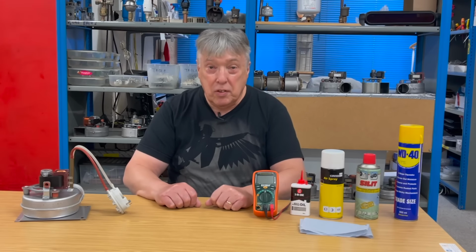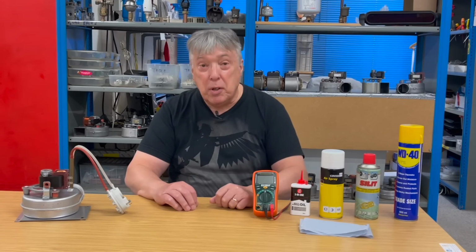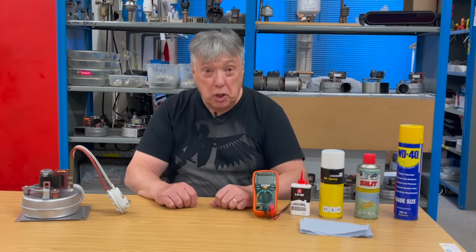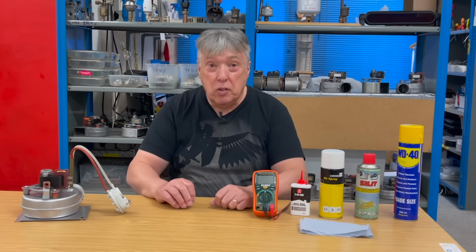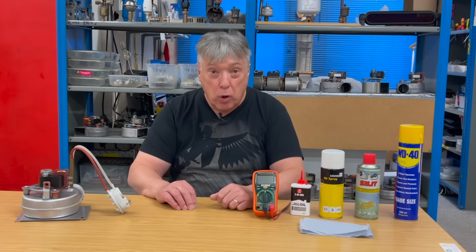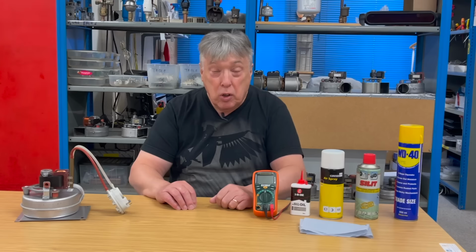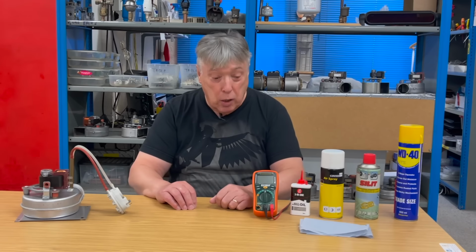Boiler fans come in various sizes. Some are AC, some are DC, some are a bit of each. So we're going to look at the AC ones, and there are two types. There's single speed 230 volts and two speed 230 volts. And we'll look at that in a little while.